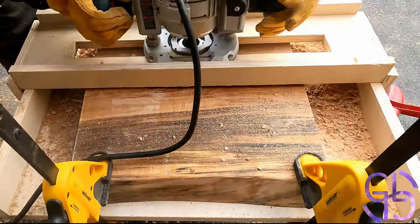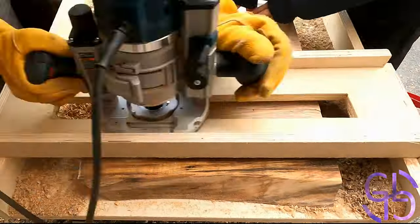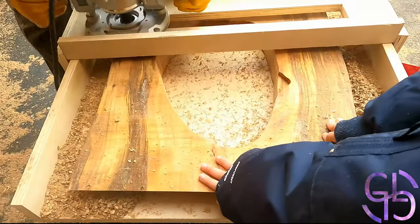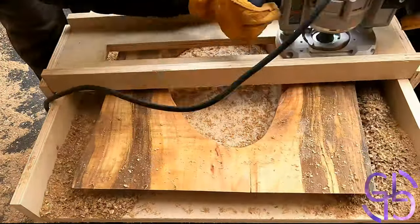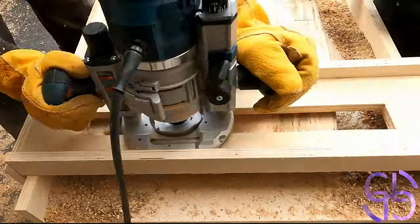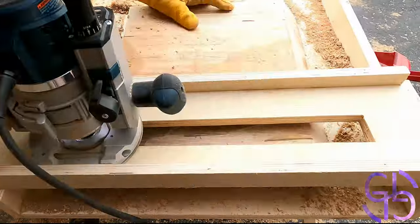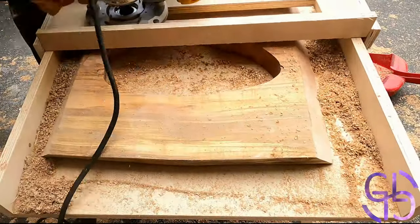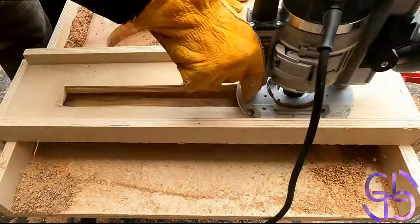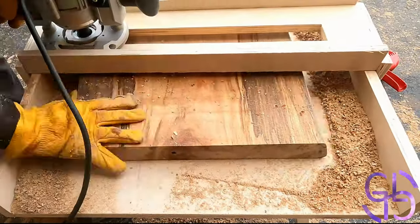So my trusty router sled came into play once again. Surprisingly, unlike my slab, this one had horrible warping — I'm unsure why it happened. Both slabs came from the same tree, were stored the same way, and had the same thing done to them. But my thinner slab barely had any warping whereas this one warped by half an inch — that was huge. So I ended up routing it down to 1 and 5/8 of an inch. I was very sad to see all that thickness go, but it had to be done unfortunately. If you guys have any idea as to what might be the cause, please do let me know. I really would like to understand how the same piece of wood treated and stored the same way can have such different results.